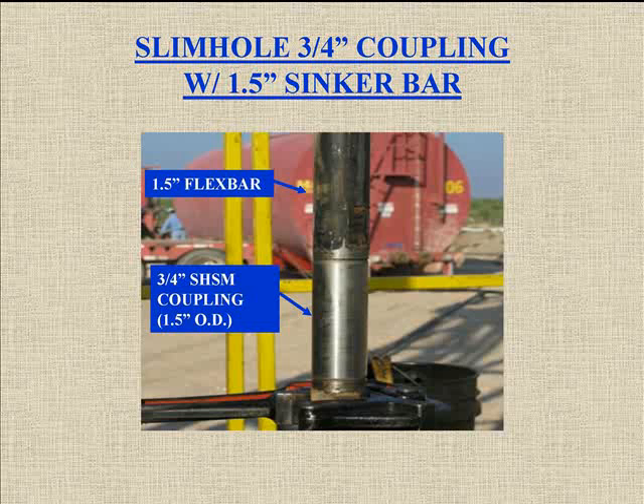We had two failure samples of tubing that still showed an imprint of a three-quarter rod box in our sinker bar section. We're still getting buckling — not nearly as severe, but enough to remove the corrosive inhibitor film and cause damage. So what we came up with is to just run a slim hole coupling. If you've got three-quarter pins on your inch-and-a-half sinker bars, run a slim hole coupling and then you've got a uniform OD the complete length of your sinker bar section. You have no concentrated area to wear, so you spread the wear pattern out.